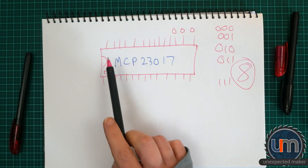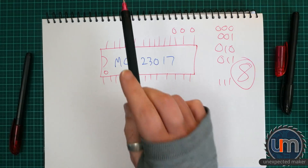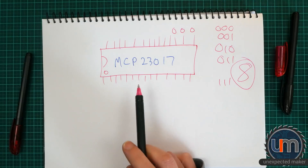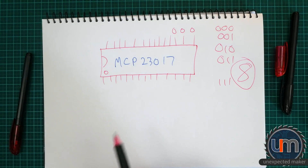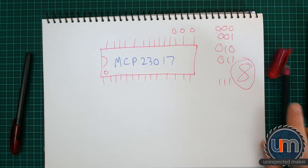Because I've got full 16 GPIOs on this chip, I can control each LED individually and with full PWM. So not only can I turn them on and off via I2C, but I can adjust their brightness — or do fancy things like make them flicker. I'm very excited by that. So that's what I'm going to do.